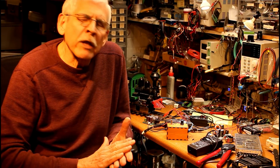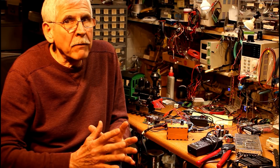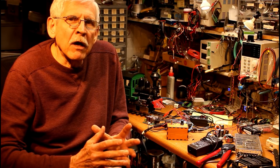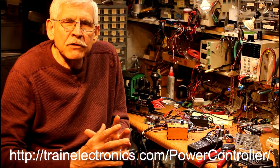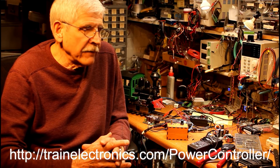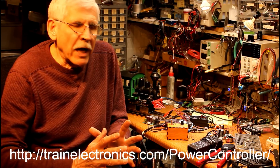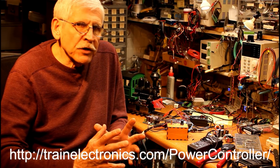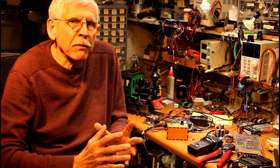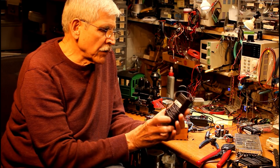What I frequently will say is, if you're willing to do a little bit of wiring — not much — you can build your own from off-the-shelf parts. What I'm doing with this video and the accompanying web page is trying to document exactly how you can do that for very little money. The first thing you need is a fixed voltage power supply, and there's a source you may not think of: computer power supplies.